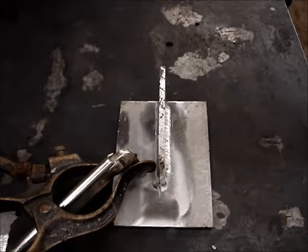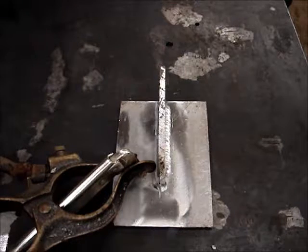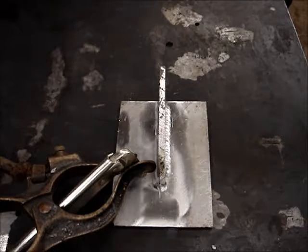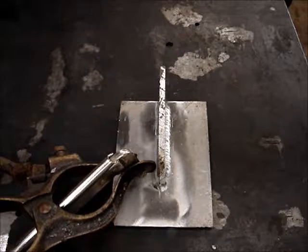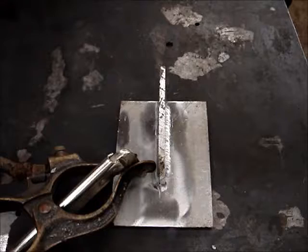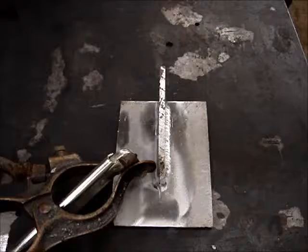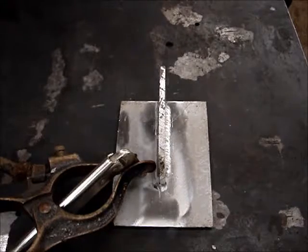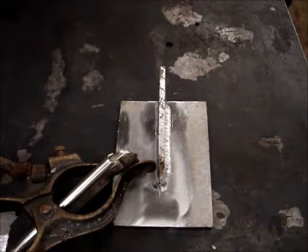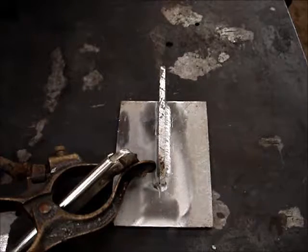Then I spoke of the welding machines, the Syncrowave machines, which was a Miller machine, and the new Miller Square Wave, which is the new Dynasties, and that's a Square Wave, and that's the machine that I have. And Square Wave is the best technology. The old Syncrowaves used high frequency and it was continuous high frequency. So besides having the welding machine, you needed a high frequency setup. And it ran continuous high frequency. The new Square Wave only has high frequency on the start and then it utilizes the Square Wave after that.